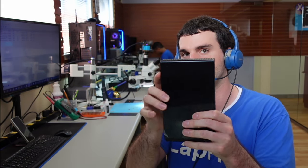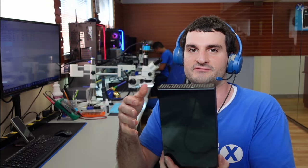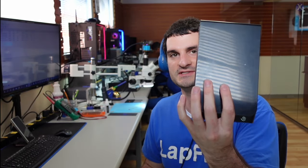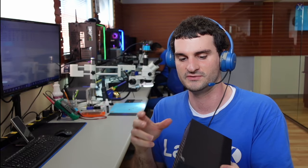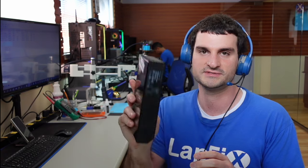Because we have a drive like this — if they're bigger like this, they usually have a bigger drive in there, especially if they're older. They have a 3.5-inch drive. Since it's a Seagate, I would hope it would be a Seagate drive in a Seagate device. There's probably a Seagate drive in here connected to a power supply and a USB board, so there's probably a controller on there with power and data going through it. We want to remove that part and just access the drive directly.